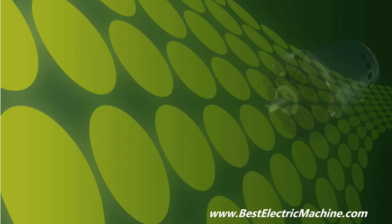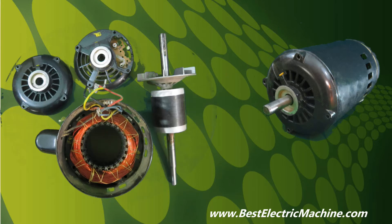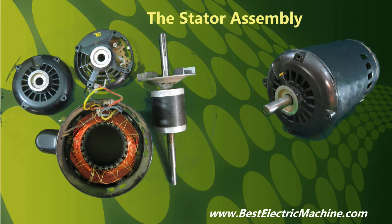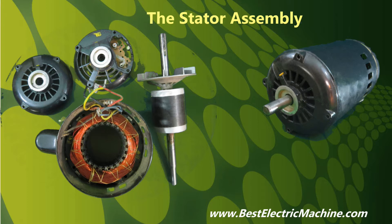All rotating or linear electromagnetic motors and generators, traditionally called electric machines, are no different from this standard induction electric motor, which comprises four basic components. First component, the stator or stationary assembly, includes a balanced multi-phase AC winding set that is excited with bi-directional multi-phase AC electrical power directly through its terminals. Only a balanced multi-phase AC winding set, which is independently excited with multi-phase bi-directional power directly through its terminals — i.e., active winding set — produces a rotating magnetic field relative to its frame that does real work, by actively contributing electrical power to the electrical to mechanical, or electromechanical, conversion process.